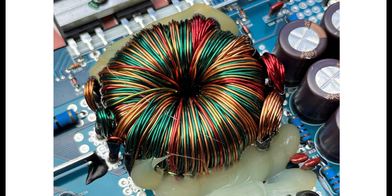Why do we use a donut-shaped transformer rather than a square traditional transformer in car audio amps? That's all to do with the shape of the magnetic field. In the donut shape the magnetic field is a sphere, rather than a cube that you'd get with a square or rectangular boxy transformer. Therefore the donut or spherical shape produces far less electromagnetic interference that would otherwise show up as buzzing, hums, and other noise in our audio signal.